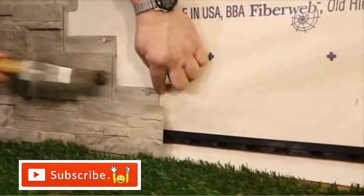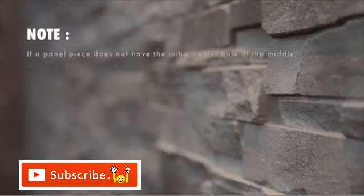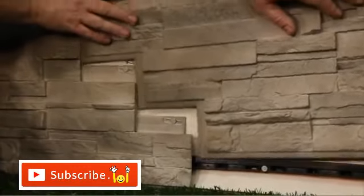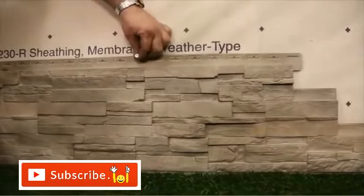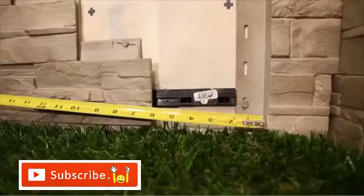If the panel is installed on a wall with furrings, a furring strip is required behind these holes. If a panel piece does not have the initial center hole at the middle, drill a new center hole of 1/8 inch diameter at the same height as the other installation holes. Install the following panel by hooking onto the starter strip and sliding into the previous panel. Nail, beginning with the center hole. Repeat this step until the end of the wall.